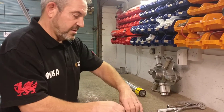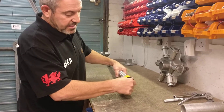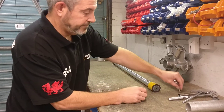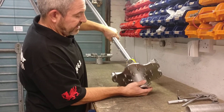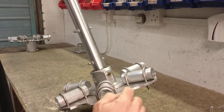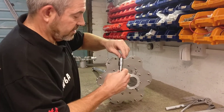We'll go through how to insert the center post into the hub. First, remove the bolt inserted into the bottom of the center post from the packaging. Note which way the washers go — you have a flat washer and a spring washer; always put the spring washer on first, then the flat washer. Set that aside and keep it safe. Next, insert the center post into the top flange — the black line needs to line up with the grub screw, and make sure that grub screw is aligned with the engraved arrow on the base plate.